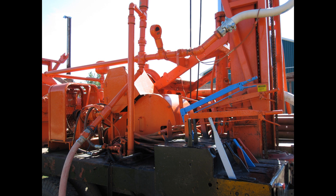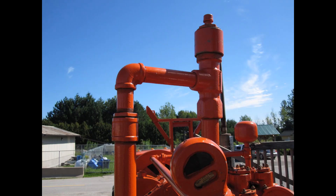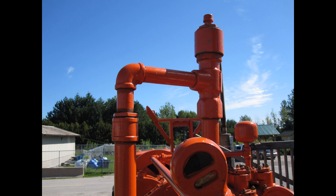If the pump is running and both ball valves are closed, the pressure will build up until the pressure relief valve releases it by shearing a nail and allowing the mud to flow, relieving the pressure.